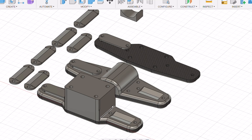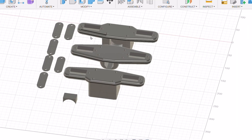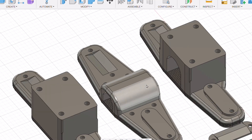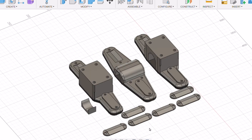That's assuming carbon fiber PLA or PETG is strong enough — if not, I can make 3D printed molds for forged carbon fiber casting. Rotating to the other side, you can see how these will be nice and flat and should fit under the back armor casing properly. There'll be ball joints top and bottom with a threaded shaft running through the center piece via a threaded sleeve, so it can be adjusted in and out. I'll get all this printed, get the carbon fiber machined, and see what it's like put together.